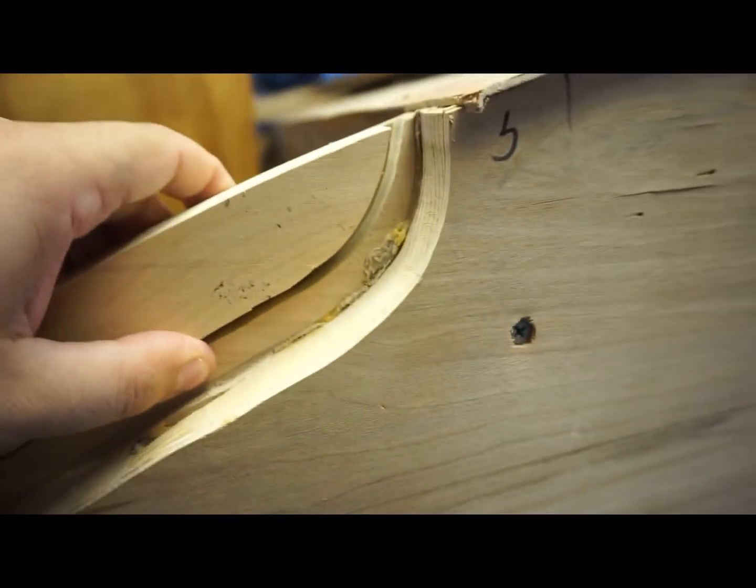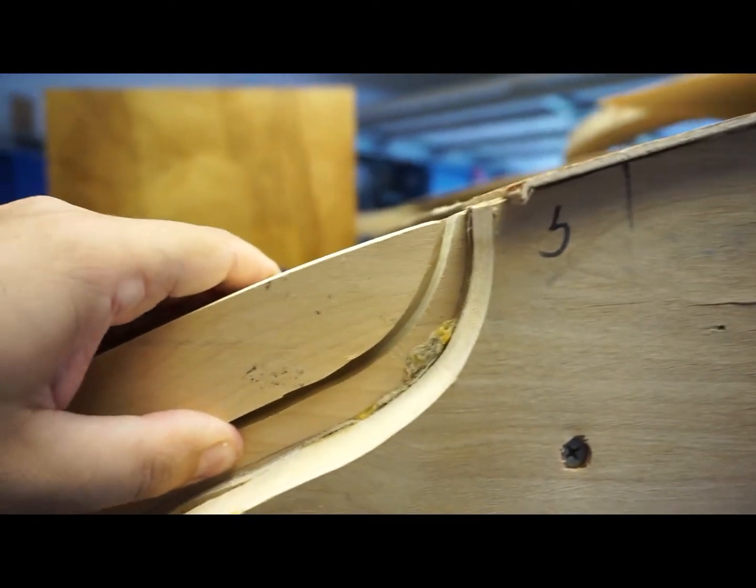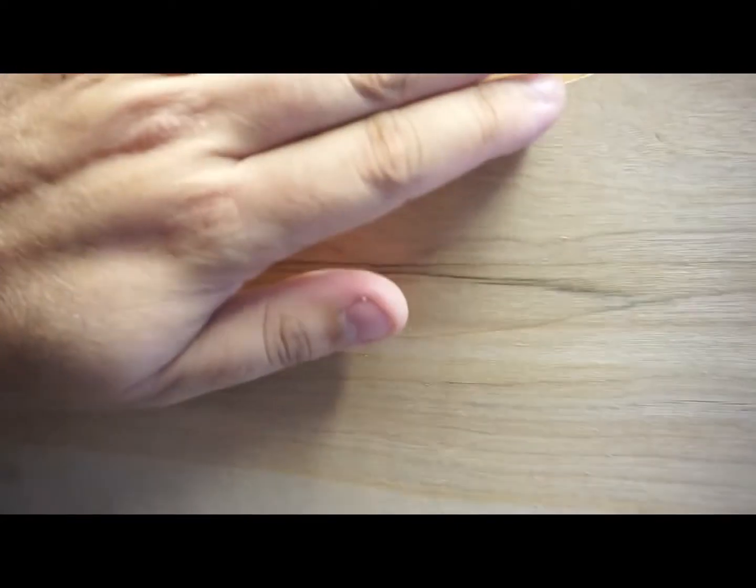You can see we've got about a quarter-inch gap between the top seal and the bottom seal. My dad is here helping me with a second hand. We're going to align and clamp that all down — that's about where it needs to be. When this is all finished there'll be a piece of rubber seal attached to this, we'll reattach our other end wall piece, and this will form our entire hatch. You can see that quarter-inch gap all the way down is where our rubber seal is going to sit, and that's what's going to keep things from leaking.